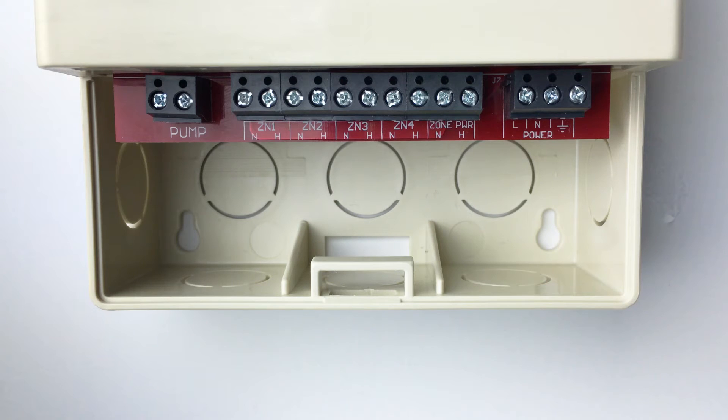To begin wiring, make sure you power off your HVAC system. Only suitable individuals with formal training in electrical and hydronic controls should attempt the installation of this equipment. All signal wiring must be a minimum of 18 gauge wire and a maximum of 500 feet.